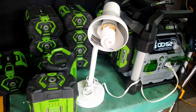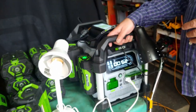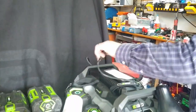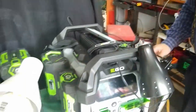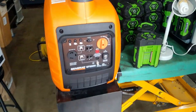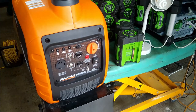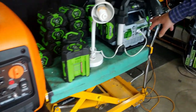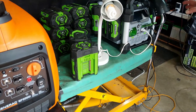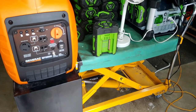Let's say we're in a stormy condition — my solar batteries are drawn down and I don't have enough solar power to recharge this. I can unplug this and use my extension cord to go over to my Generac. I wouldn't plug this in until it's up and running. We're going to pause the video, fire it up, and show you that it's actually charging the batteries. Right now the display is out, meaning the unit's not producing power for the outlets and not consuming any power because it's not charging. We'll get it running and plug it in to recharge our batteries from the generator.